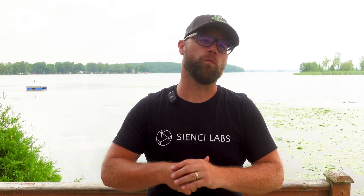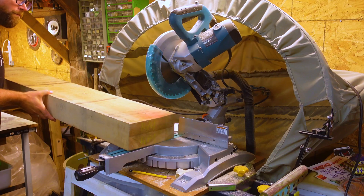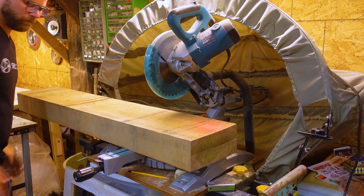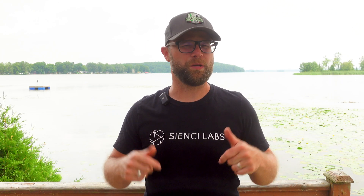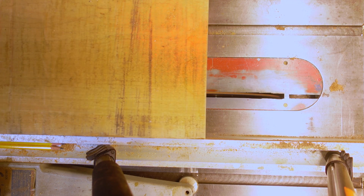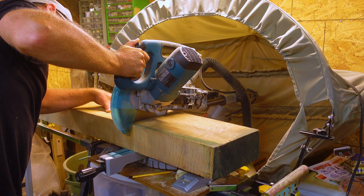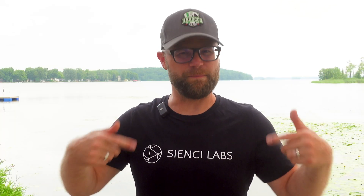The first thing I had to do was choose a piece of wood. I hit up Google to see what kind of wood is most popular for bats. As it turns out, maple is used for approximately 70% of the bats in the major leagues. I had a hunch that was the case, so I picked up this serious chunk of hard maple. I cut it down to 36 by 2.75 by 2.75 inches, which are typical bat blank dimensions, leaving room on both ends and enough material to rotary surface down.